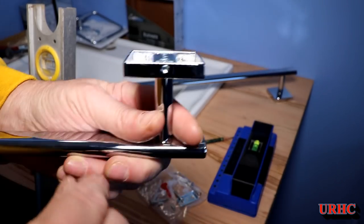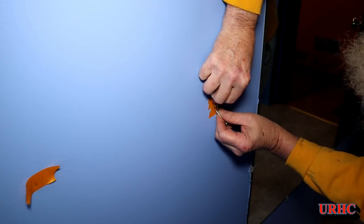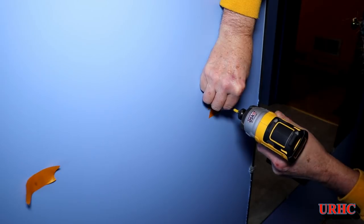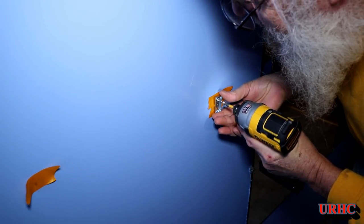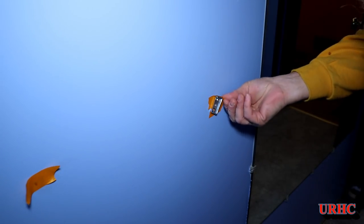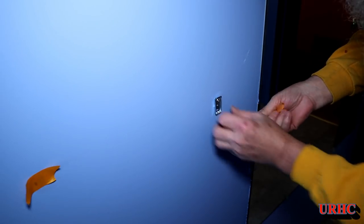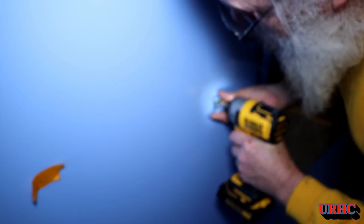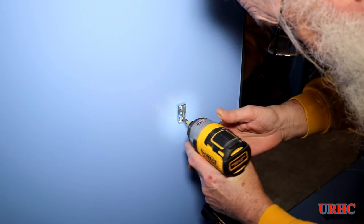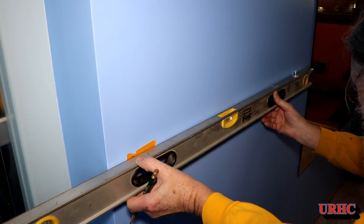They all mount with a little clip that has pockets cast into the base — the clip locks in with a set screw. For the first towel bar, it's going back over where the old one was. I sized it so I could put one side on a stud. I didn't use the hardware they gave me — I used some inch-and-a-half Kreg screws instead. I put masking tape on the wall, used the stud finder to get the center of the stud, and that side is a really simple install going right into the stud.